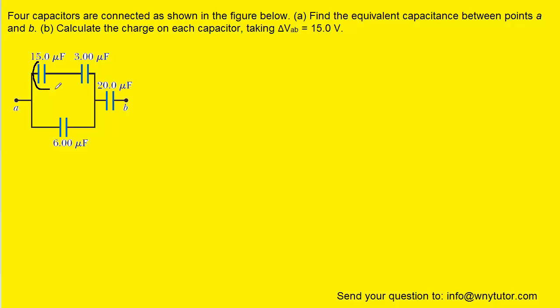To do that, we're going to first combine these two capacitors into a single equivalent capacitor. We'll notice that those two are in series with one another, so we have to follow the series capacitance equation. In this equation, C1 and C2 represent the capacitances of these two capacitors. We'll go ahead and fill in 15 microfarads for C1 and 3 microfarads for C2.